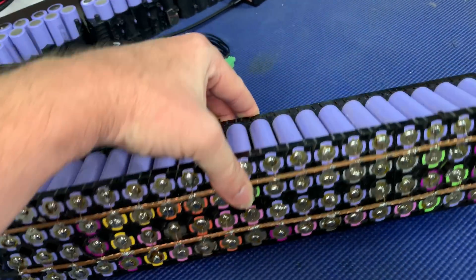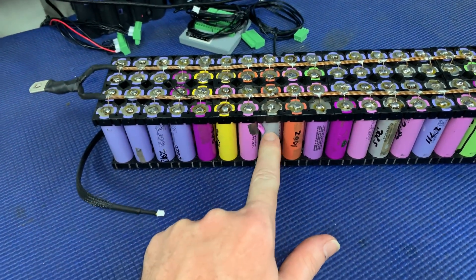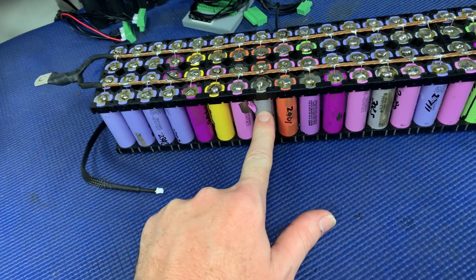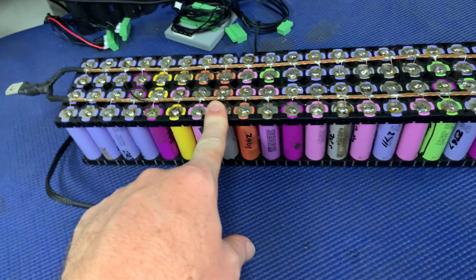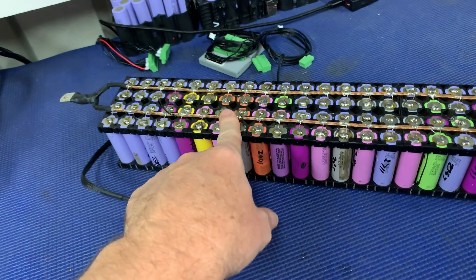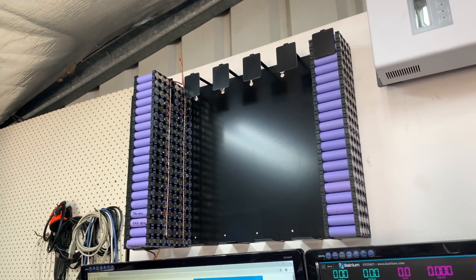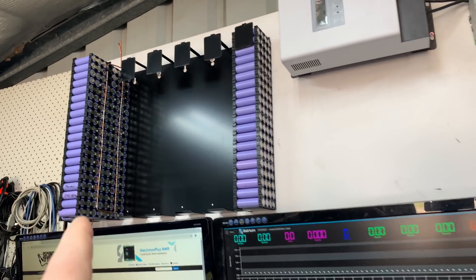I've finished with that one — there's not much more I can do. We found the heating cell. I left it in there; it's just not worth it for the extra couple of amp hours and the damage it'll do. It's all disconnected so it can't cause any more damage, and she's down to zero volts, so she's good to go. Now I'll get this other cell down, get some lugs and heat shrink on it, get it out to the farm, and get it swapped over.